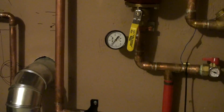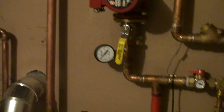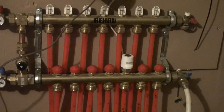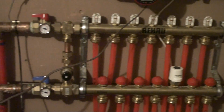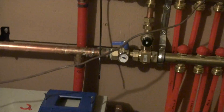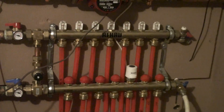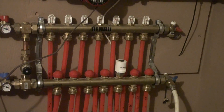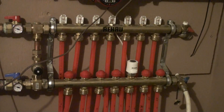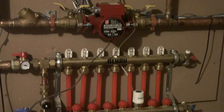This loop over here is the mixing loop. If you follow it there, the mixing loop goes into the manifold, and the manifold has seven loops on this side going into the floor — hydronic heating. And those two lines go over to a manifold on the other side of the house, exactly the same as this one. That little white thing there is an actuator — it controls that zone, turns it on and off. There are five more of those on the one on the other side.